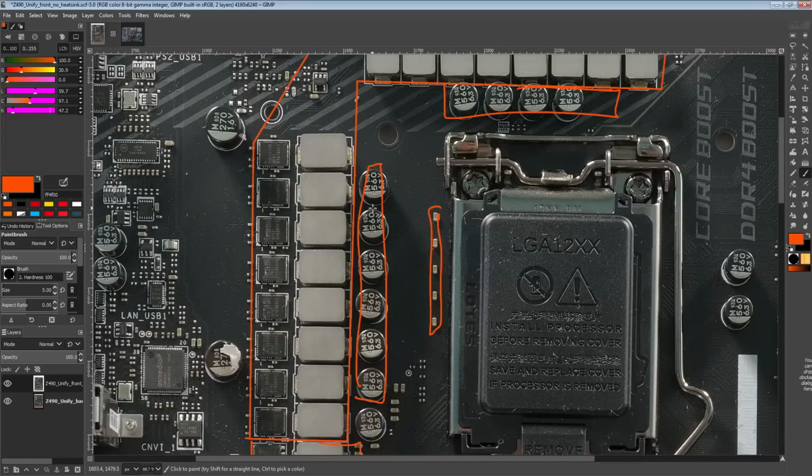The best transient response board I tested from Gigabyte was a little overheating-prone 6-phase ITX board, but that board just happens to have most of the bulk capacitance jammed right up against the socket, whereas even something like the Z370 SOC-LN2 board, which is a true 8-phase, so also no doublers, same as the ITX, has the capacitors quite a bit further away and loses to the ITX on transient response.